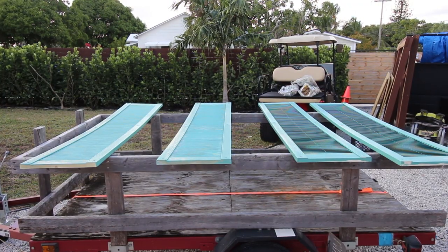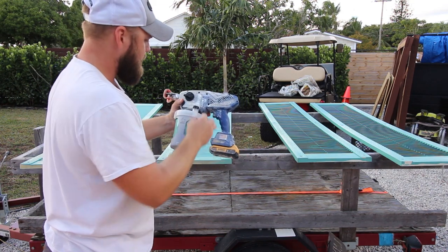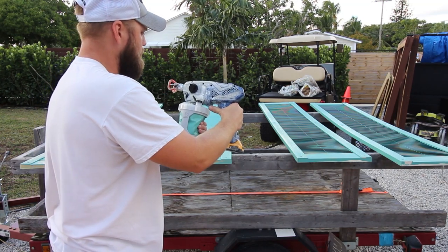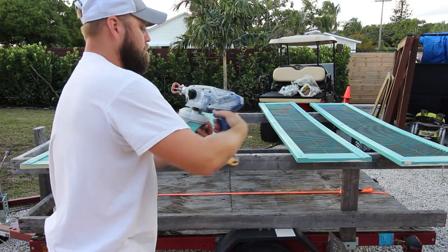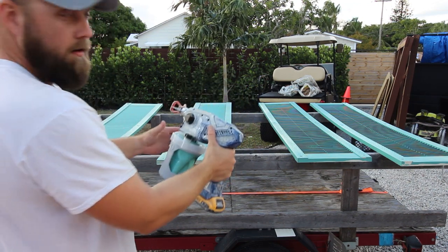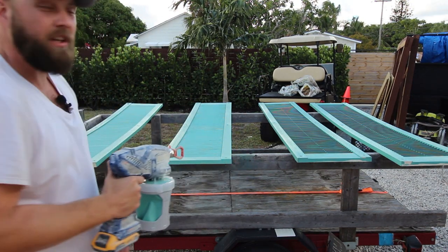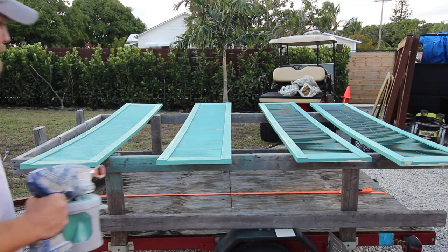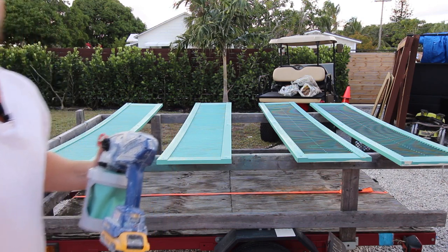It's a little windier than I like today, so I'll try not to get overspray all over me. But for the very first time we will prime the new pump. I'm going to squeeze the air out of it. There we go. I usually spray it about a six. This is just a latex exterior paint and it's not thinned or anything like that. Oh yeah — you can hear the difference. That's better. That's actually probably a little more pressure than I need, but I'm going to rock and roll with this. I'm going to unplug this microphone and get to it.